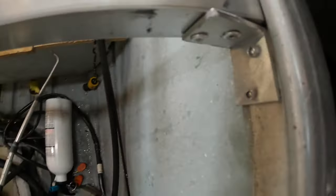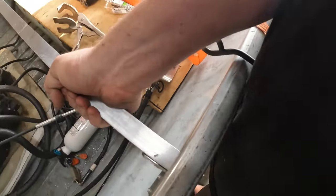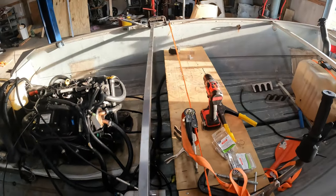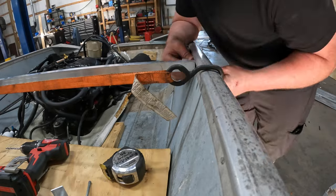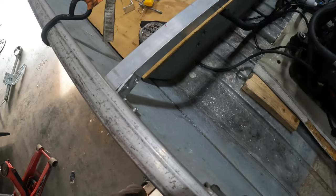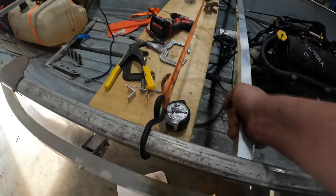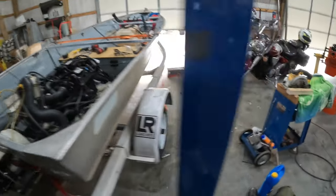I know I'm not great at explaining things, so I'll just show you what I did. I've got four rivets — two into the square tube and two into the gunwale to hold this piece. Super solid. I do have a ratchet strap here holding the boat; I pulled it together so it would stay tight when I riveted it. Now I'm going to do that side and see how it feels. Got this side riveted on. Some of these rivets are breaking off kind of far out, so I'll come back and cut those off so they're not sharp. Now I'm going to let the ratchet strap off, and if everything holds, the boat shouldn't spread out anymore.